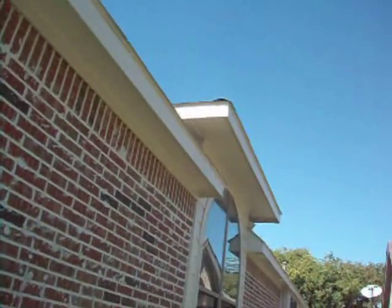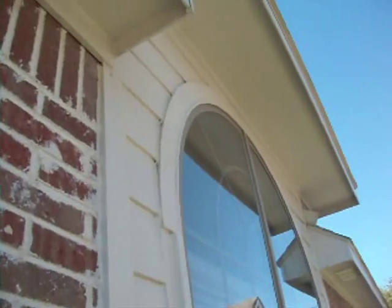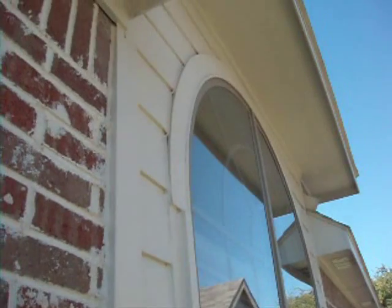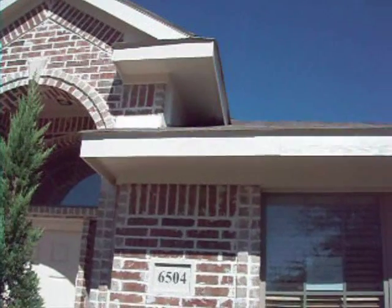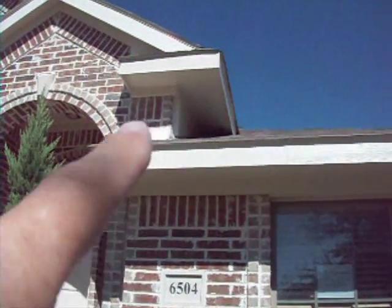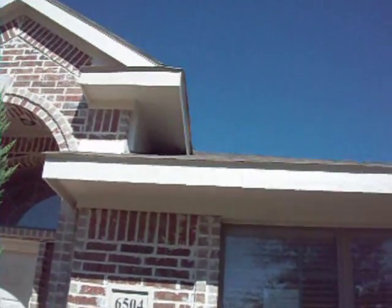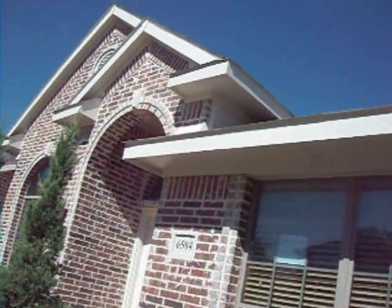This is the right elevation. Up here you've got a bit of failing caulking — you can see the caulking around here needs to be re-caulked; it's just seasonal expansion and contraction that's caused that. I'm looking at the front gable and there's water damage in this area. You can clearly see the staining — water may have got into the house some time ago, it's been fixed, but there's water damage there and there could possibly still be a leak.